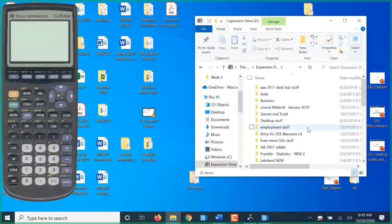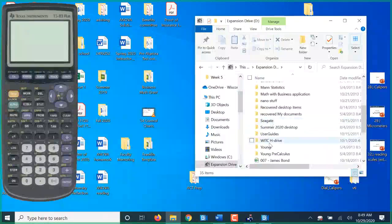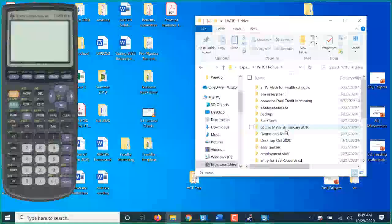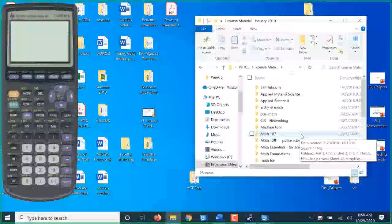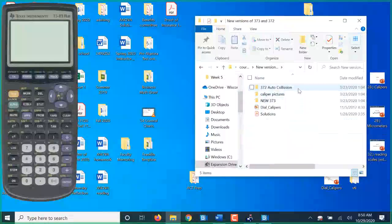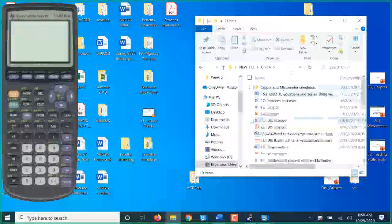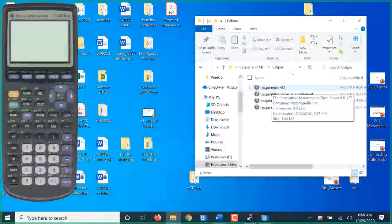For many years the dial calipers were not very precise because it was tough to manufacture dials that were precise enough that they worked well. There was always a lot of slop in the dial calipers. They have since fixed that. Dial calipers are the standard in the industry now. They are pretty precise. I hear people all the time say, well, I'll just use a digital caliper, which is fine. But first of all, if you're not spending $300 or $400, you're not getting a good digital caliper. Also, you need to make sure that you calibrate it literally every few hours.